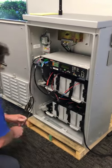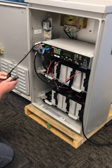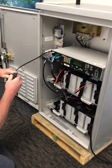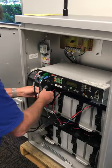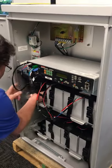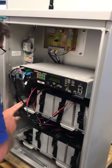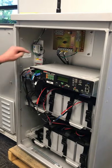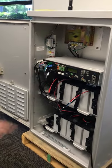With both of those plugged in, in this particular cabinet there's a cable that plugs in for the fan that converts it to an IEC connector, so you can plug that into the front of the unit. Since we're all plugged in, the cabinet fan just started running because we've already got power going to the bypass box. Even though the unit's off, there's internal automatic bypass, so it's feeding utility power to the output.